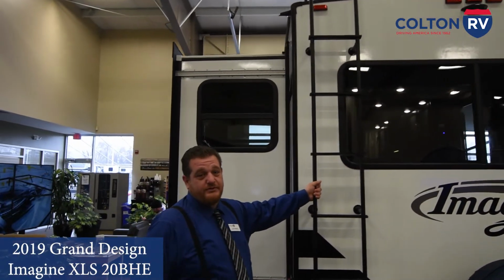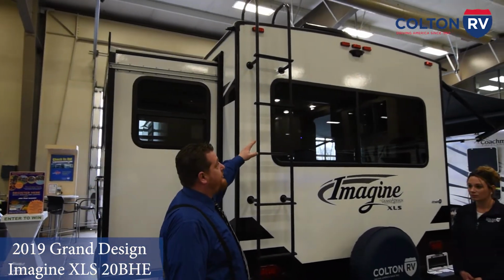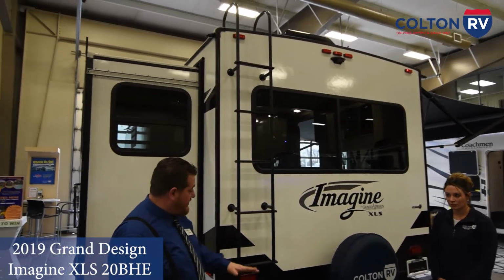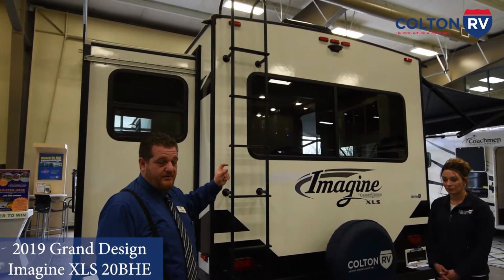Walkable roof. So you have a 12-year warranty on the TPO roof. It's fully walkable. Quick bit about insulation too. The insulation on the roof is R40 value. Insulation underneath is R30 value. The walls are R7. They're 1.5 inch framing there.